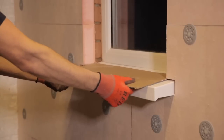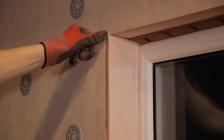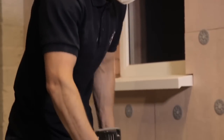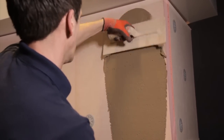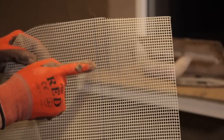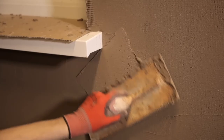Sills should be protected using appropriate methods. An adhesive is mixed with the recommended amount of water and is used to fix 20mm thick insulation to window and door reveals as required. AluMask scrim adhesive and the specified amount of water are thoroughly mixed using a paddle mixer to achieve the desired consistency. Leave for 5 minutes and re-mix prior to use. The product is then applied by trowel to the insulation boards at approximately 3mm thick. While the adhesive is still wet, embed the reinforcement scrim using 75mm overlaps, making sure the scrim is fully covered and not visible. Reinforcement scrim is to be returned into window reveals and around external corners. Additional 500 by 250mm scrim patches are installed at external corners of all openings.